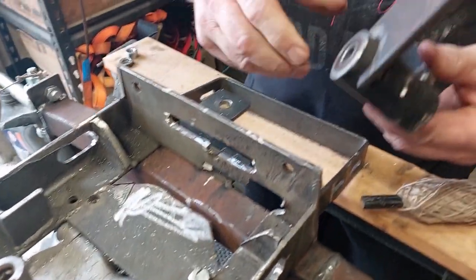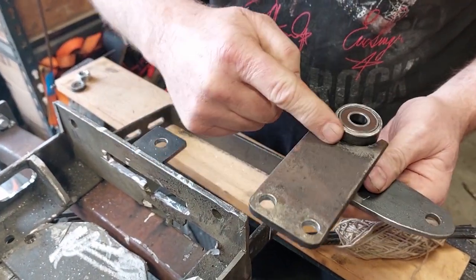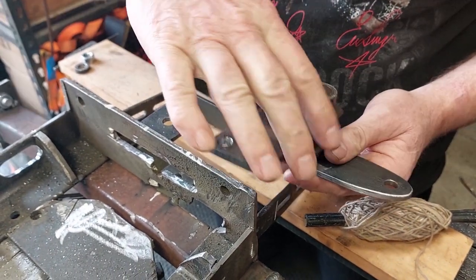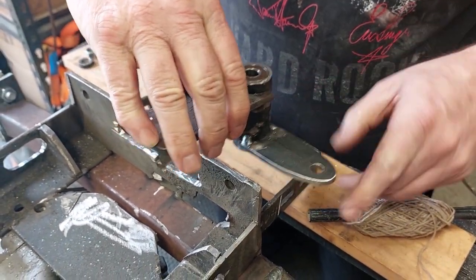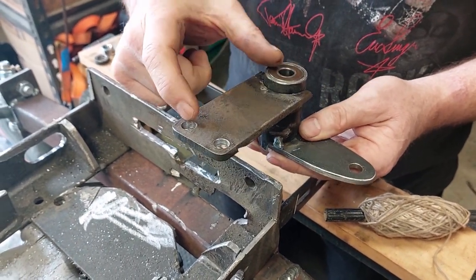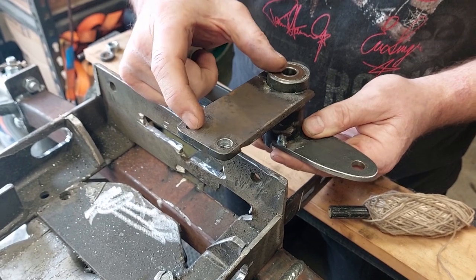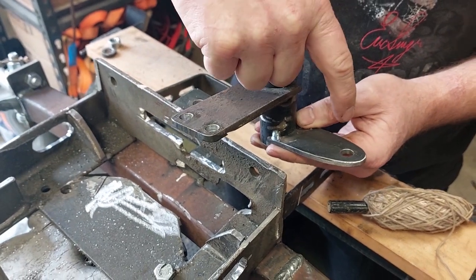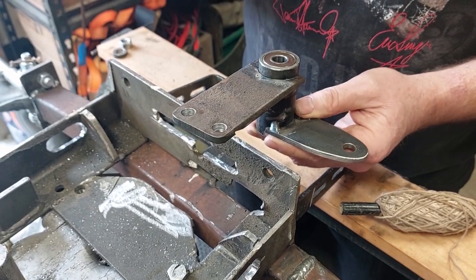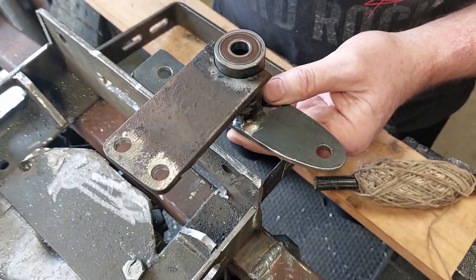So we've got this piece here. Originally you saw this we put onto here to put the 2 hinge joints onto each side. We've added this piece onto here. If you want to know the dimensions, just hit me up for those. I think from memory it's about 90mm from the centre, and about 70mm for there. So the idea is this is longer than this one, which gives us a bit of a leverage effect, which means it makes it slightly easier to steer.